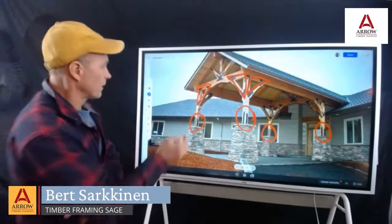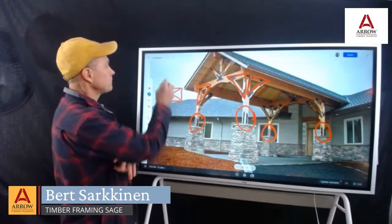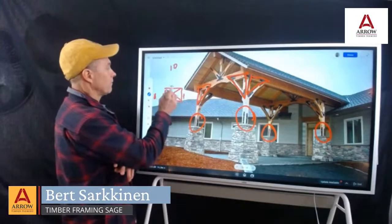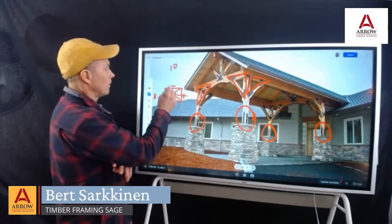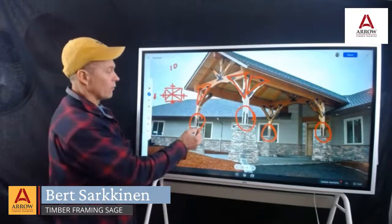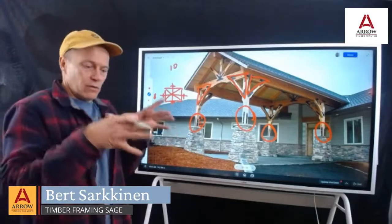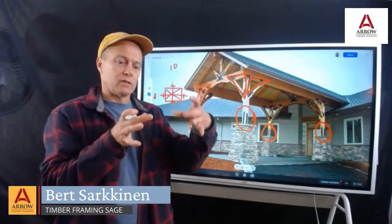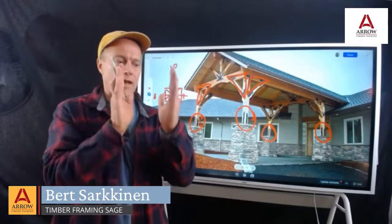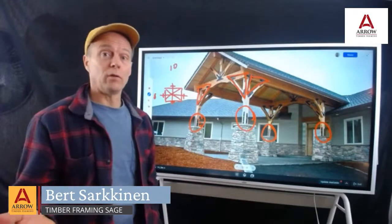It's basically looking from the top. Say the footprint of this is, let's just call it an 8x10. Looking from the top there, 10 inches, 8 inches, and we've got a strap here, strap there, and then bolts going through, right? And they're offset. Well, what is applied here is how many bolts, how far away do they have to be in order to use leverage to resist leverage? So you're looking at this footprint right here, how many bolts have to be there and at what distances to prevent that from lifting, tipping from one corner to the other. And if you can figure that out, it can't tip over, just as long as that won't rip up. So it's another way to address lateral bracing.